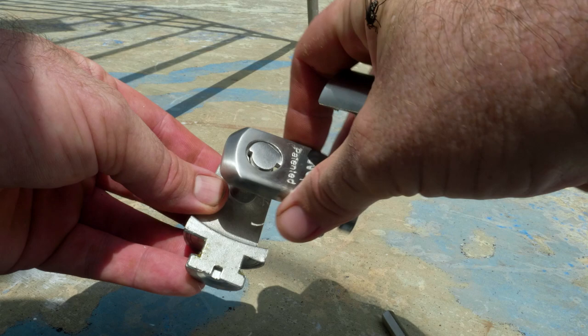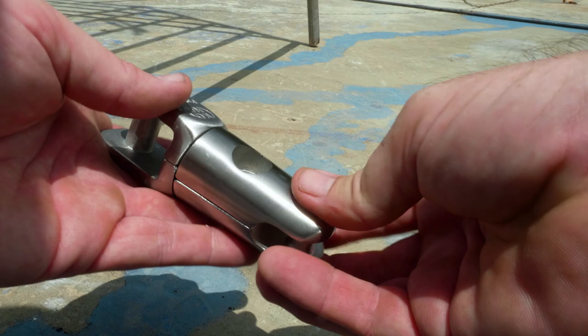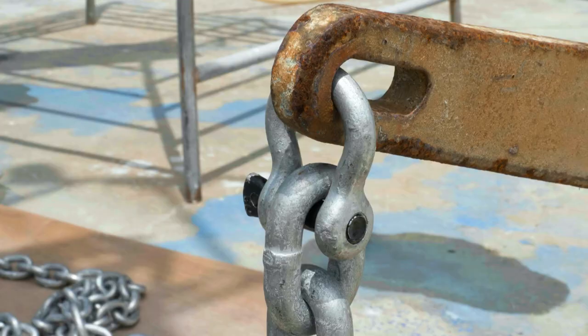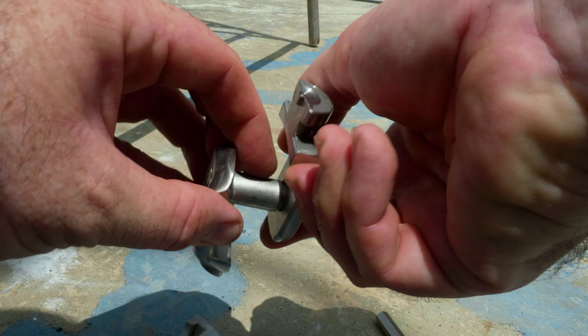In Viv's conclusion he even states that a couple of swivels available are even stronger than your actual chain. It's all about the connectors. We have a Kong swivel — so we have that extra space — and a new shackle. You brought a better half-inch shackle back from the UK. So the full setup is: a half-inch shackle, five links of 12mm chain, the Kong swivel, which then connects directly to our new 10mm chain. Beefed up and feeling a lot more confident with that.